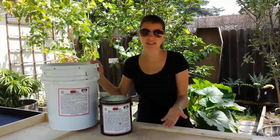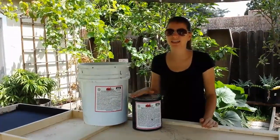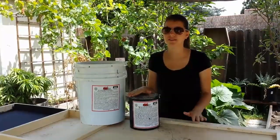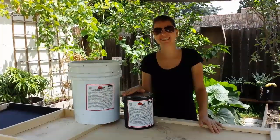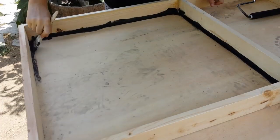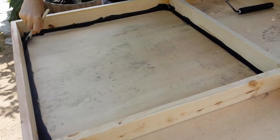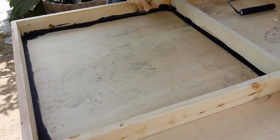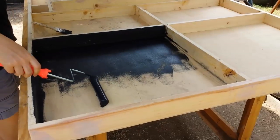You can also get an additive and add it to a regular paint. I've been able to stretch one gallon of this paint for about six sides of these four-by-ten panels, so that's not too bad. When painting the backs of the walls, I use a brush to get in all the corners and then I roll the center areas.